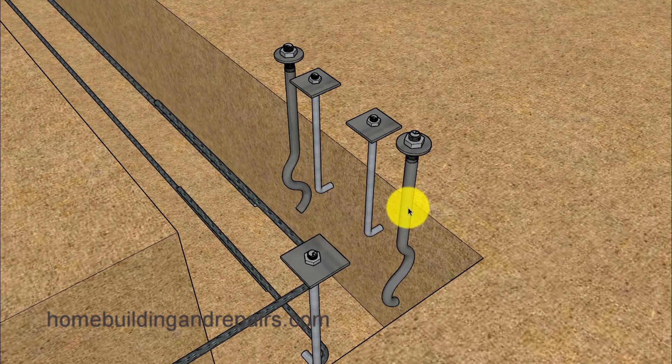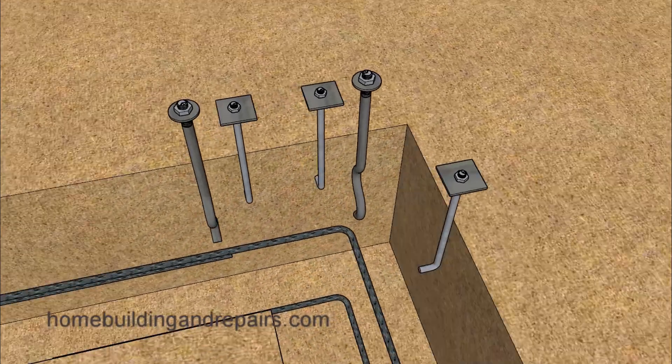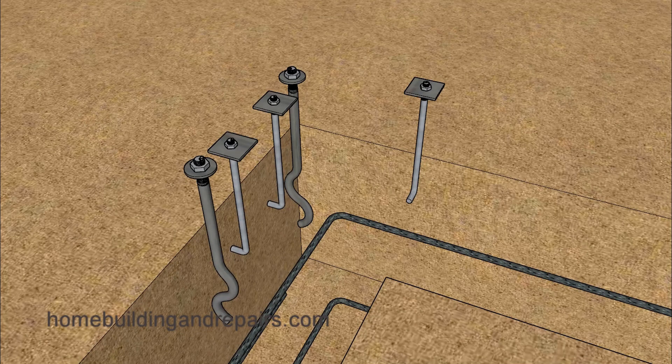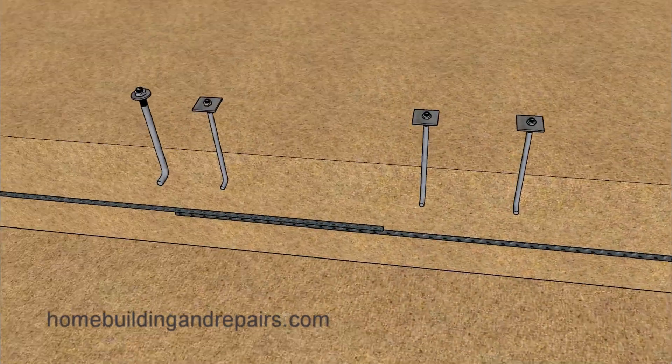Please don't ask me for specific sizes — these are only meant to be used as examples. If I suggest this is an HD10, HD14, or HD40 and you think that's what you need for your particular garage, you might not need hold downs that large. You might not need large anchor bolts or wide, deep footings. It's going to depend upon the area you live in.